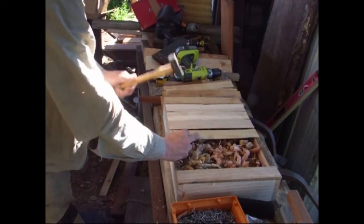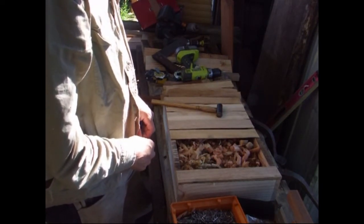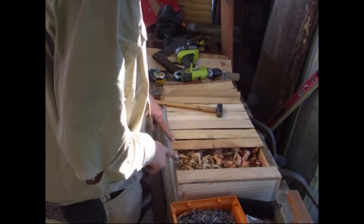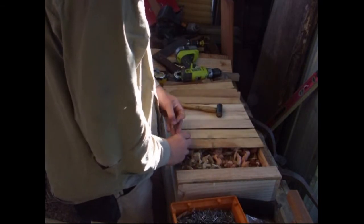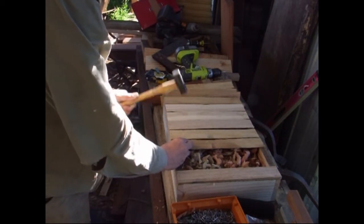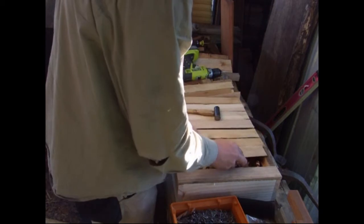And oak's got a tangential movement rate of around 7-8%. Which means that if this was 100mm and it's fully shrunk, and it was to be fully wet again, it would increase in size by 8mm. Now it's not fully dry and it's not going to get fully wet, so it's not going to move that much. So a gap of about 5mm — probably a bit less actually — between these is enough. Whereas on a shingle roof where there's much greater chance for them to get wetter from time to time, you need to allow a little bit more room with 5mm even.